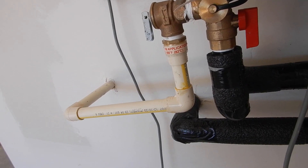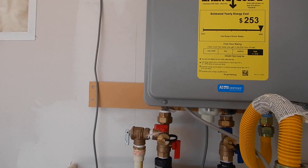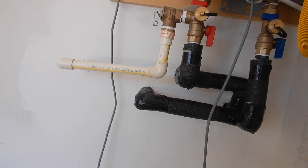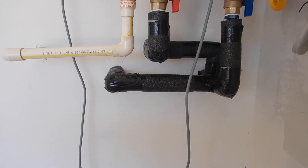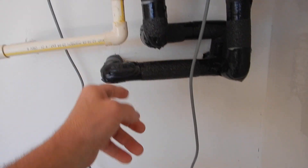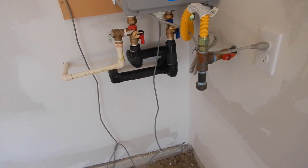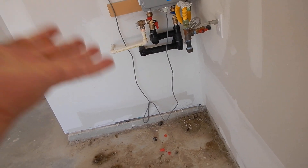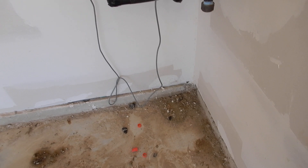If we put a vacuum breaker on it, that's going to make a mess. Well, then we should have a safety pan. The easiest and cheapest way to meet the code: put your piping into a deep pan, have the deep pan here and run it out the wall. Everything's fixed for a couple bucks. I'm going to spend hours arguing about it — three phone calls. Just do it right. That's not a big deal.